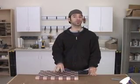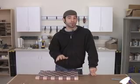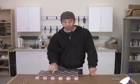Now the next step is to give the board a final sanding to either 180 or 220 grit. Keep in mind that since the entire surface is end grain, the sanding is going to take a little bit longer than usual, but just be patient. If you see any little white scratches on the surface, you need to sand just a little bit more.